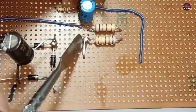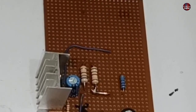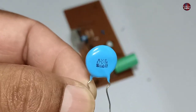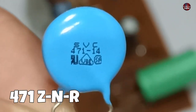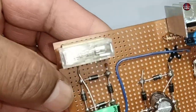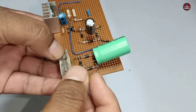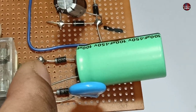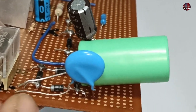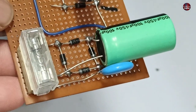And I have connected a wire with the ground and soldered it at the next trace of the Vero board to get multiple connections from the ground. Now I will make the circuit safer by installing safety components. I will install a fuse — if it's available, you can use it; otherwise, there is no issue. In the same way, I will install a 471 ZNR, which will protect the circuit from high voltages. The fuse will be installed with the bridge rectifier AC electricity point. The main electric supply will be attached to the second pin of the fuse. I have installed the second safety feature, the ZNR, and from this point we will get the main electric supply. The electric supply will pass from the fuse to the bridge rectifier. The AC neutral will be installed at the second pin of the ZNR, so I have installed it between the phase and the neutral point. If voltages exceed 250, the ZNR will short circuit, and the fuse will burn.